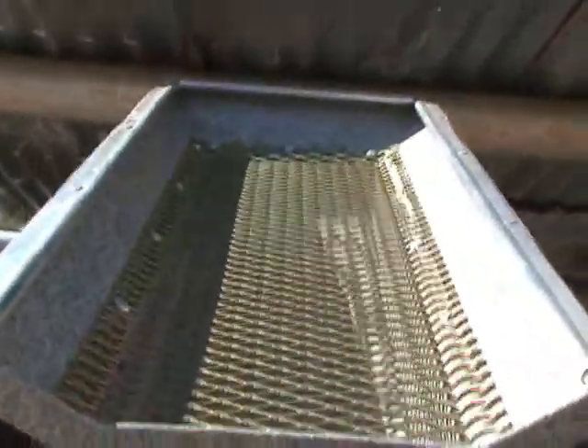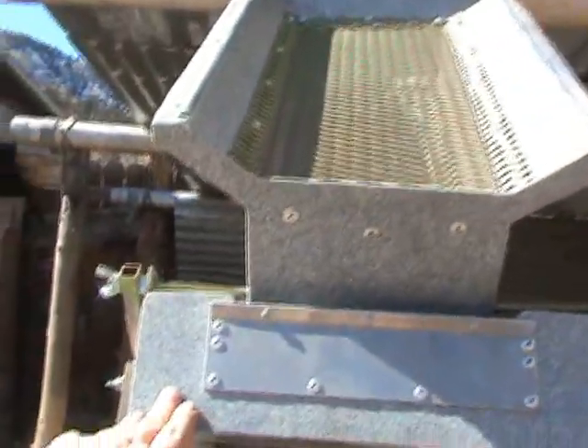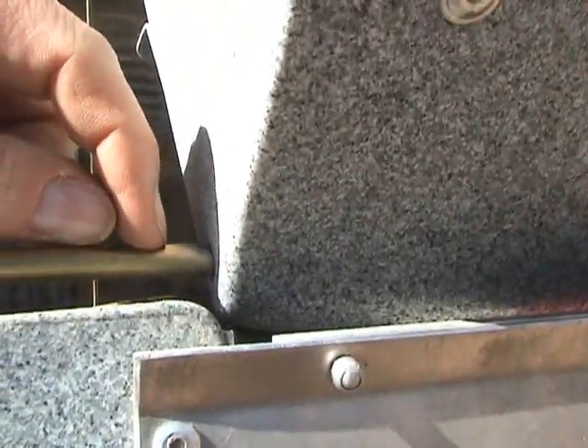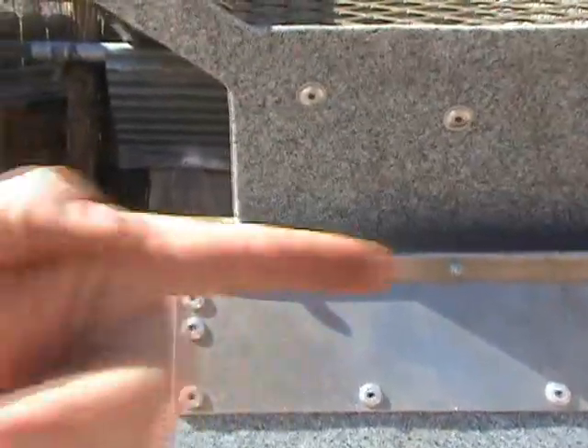You will take a look — the hopper bin here is supported by a bar. You will notice that the weight of the hopper bends the bar a little, so it is bowed. You will also notice the wear marks from about there up to here and from about here to here. The hopper is moving back and forth. This is a bad thing. So one modification is to support the hopper by pressure upwards and to center the hopper as it is in operation so it does not move left and right.